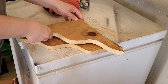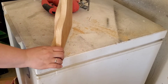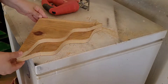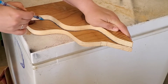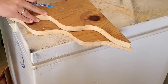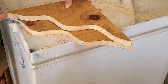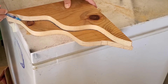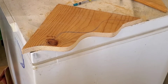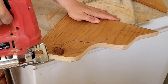This was the first corbel and I decided I'm going to flip it over to the other side and trace out the shape. I had that diagonal line and thought if I kept to the side of that diagonal line it would be okay. The bottom here was just a little off, so I decided to line up the diagonals and make sure I could get a similar shape. These are not absolutely identical but they're very close, so they look pleasing to the eye.